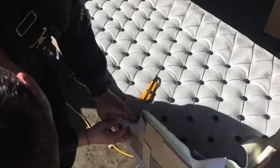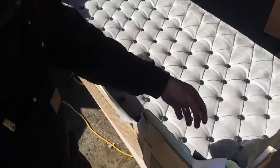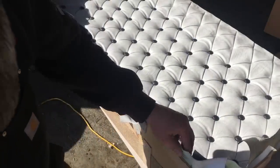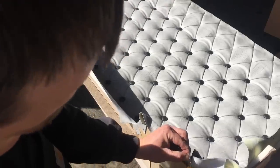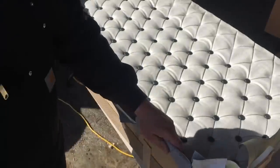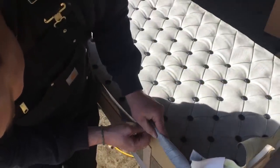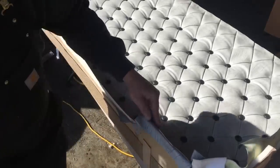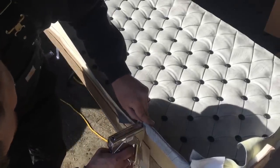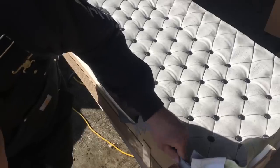Everywhere I turn there's something else to do. I had this up there and then I realized all these edges needed to be folded down. You do get smarter as you go. I'm trying not to cut too far, and I'm still using glue but also using a stapler with short staples - I think this is the right way to do it to hold it nice and tight. Yeah, it's way better than what I was doing before. I'll be an upholstery expert by the time I get this project finished.